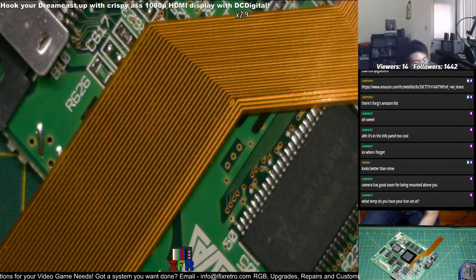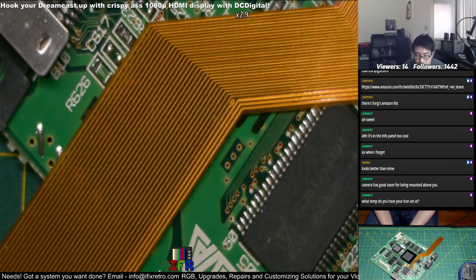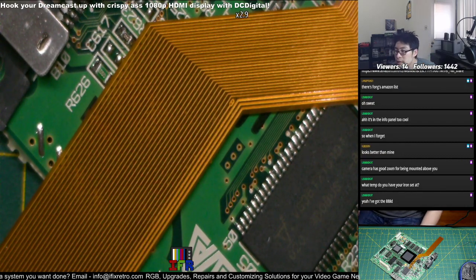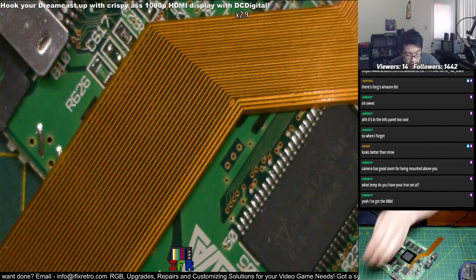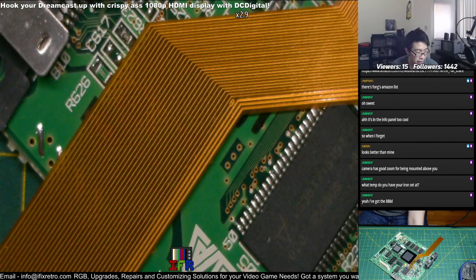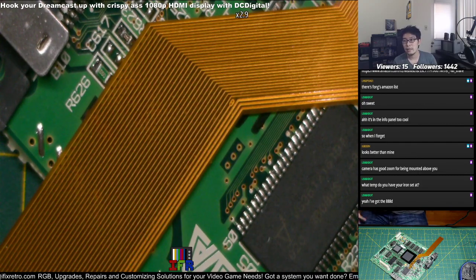It doesn't work like the regular Hakko iron that I have. Heat inductive soldering irons are really good because it takes no time to heat up the tip, and it cools down quickly too. The 888D is pretty good too, I've had that as well. It's pretty reliable, but it takes a little too long for the heating element to heat up, whereas with this one the heat is from the tip itself. You just plug it in and it heats up really quickly, and when you shut it off, it cools down really quickly too.